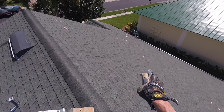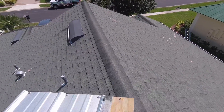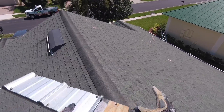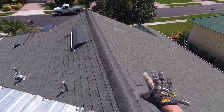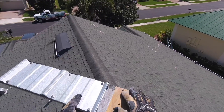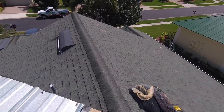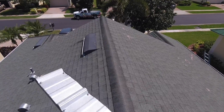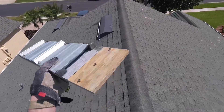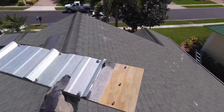In closing: remove all the shingles, get down to the bare plywood. Any of the bad plywood we're going to replace and not charge you extra for it. We're going to cover the entire bare plywood roof with a waterproof barrier, then re-nail the surface to code placing new nails every four to five inches. Then we're going to put your new 30-year shingles over top of that. That's a brief overview — I'm going to get down and talk more with Ed and Bernice. Thanks.